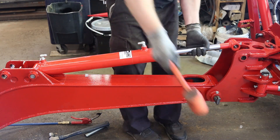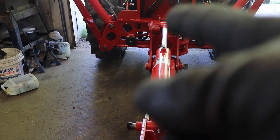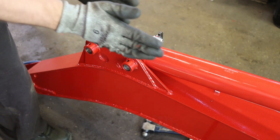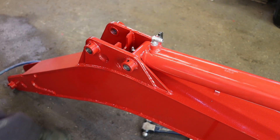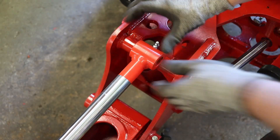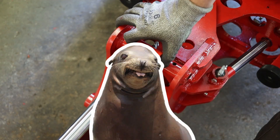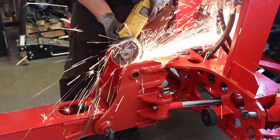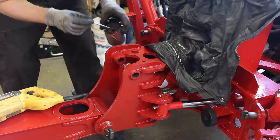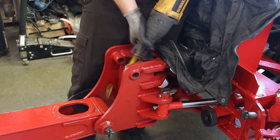Remember how crucial the cylinder mount alignment was? Here it's a case of misalignment — maybe a few thousandths off on the plates gave me a 1/8-inch offset at the cylinder end. If I barely pry on the rod it fits, but once the cylinder is completely retracted it might be rough on the seals, and I don't want that. So I just need to cut a small slice.